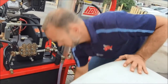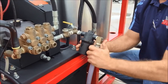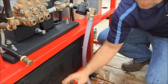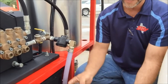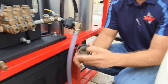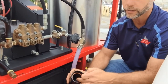You've also got a water filter right here — a canister-type filter. It has a screen on the inside. Here's what most people do: they empty it out, and there's an orange O-ring in there. Most of the time it hits the ground, they don't see it, they put the canister back on, and there's no seal between the can and the filter top. So you suck air and it will not prime the pump. Make sure if you dump that out and clean it, that O-ring doesn't fall on the ground — or if it does, put it back in.